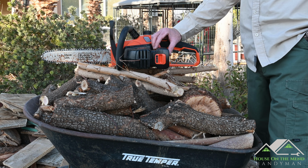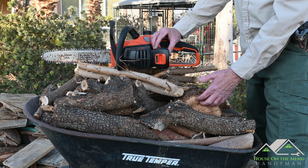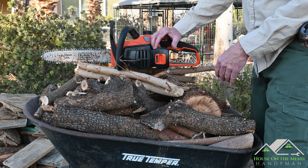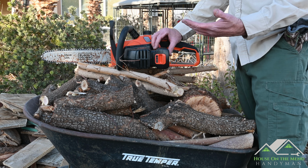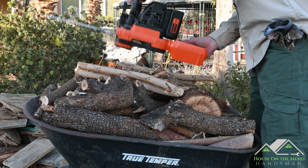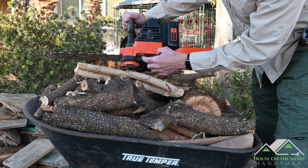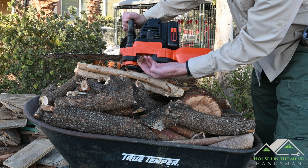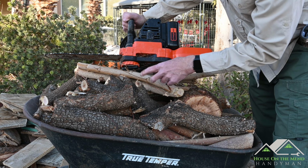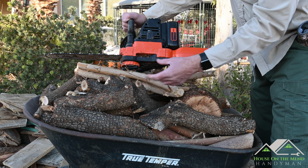I think when I first showed you that it was already down, it was because it was getting really worn out by cutting these big 9-inch diameter logs. It's been handling everything else no problem. I'm interested to see how far it would go on this battery, but I still want to take advantage of a little bit of the daylight we have left to look at some other things. First of all, I want to look right in here and see how filled up we are with gook. I do see quite a bit of sawdust in there and oil, which is to be expected because that means the bar chain oil is doing its job and lubricating, and that all looks really good.